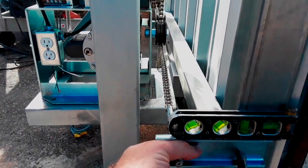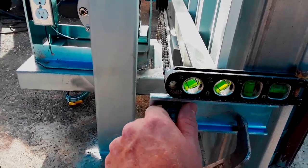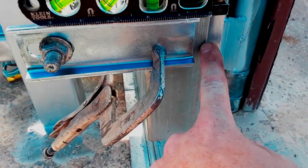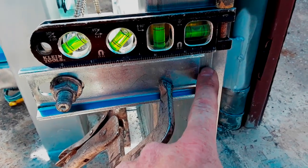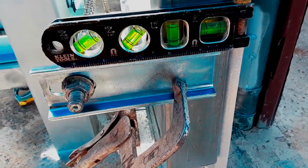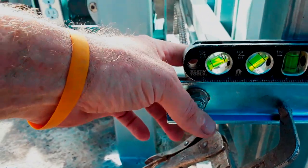I might even have a little bit more room than I thought - I'll just use the factory brackets. When you stop using the factory brackets is when this piece gets possibly half inch to three-quarter inch further out from the edge. All your strength is in this corner, not in the middle. You can go farther out but you need to weld a gusset - get a 45-degree piece from there to here - and that will give you a little bit of strength.